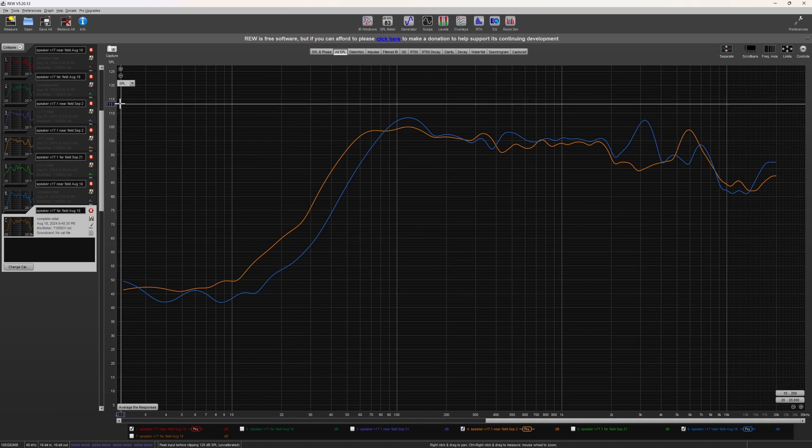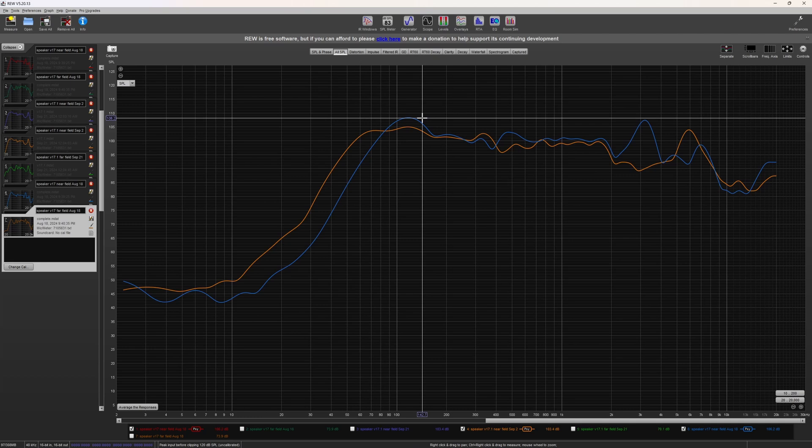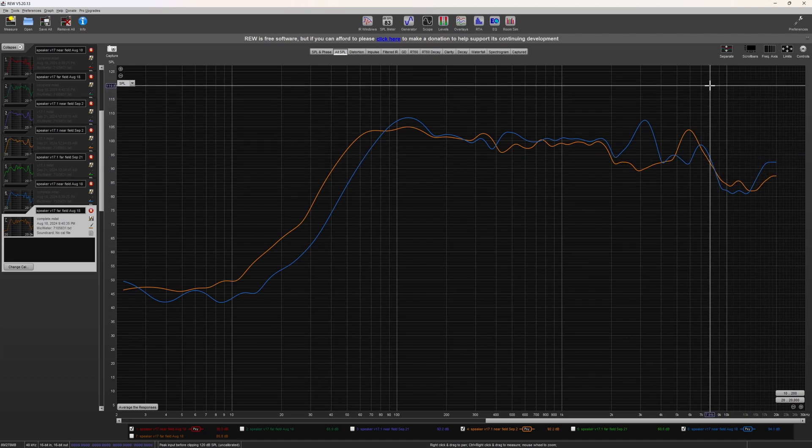We also see it doesn't get as loud as version 17, likely a result of the reduced efficiency since the moving mass was almost 60% greater in 17.1. It didn't give up much on the upper octaves though. So with a good DSP, the speaker would make for an excellent mid-range driver, as it still produced decent sound out until 8k and also had that lower octave bump. Overall, adding the composite cone and polymer suspension seemed to help the speaker perform without giving up more than it took away, so the added complexity of manufacturing seems worthwhile in this case.